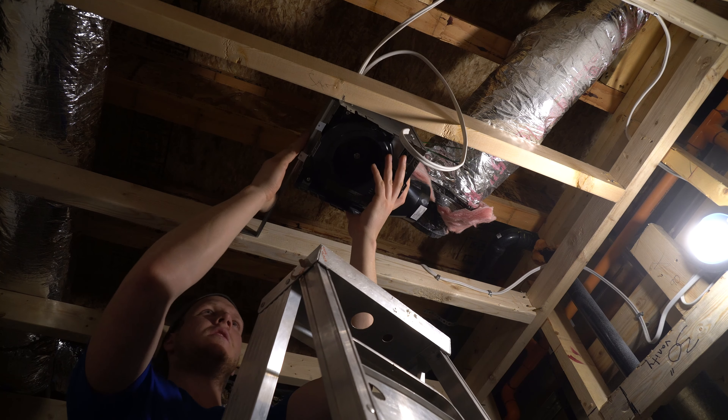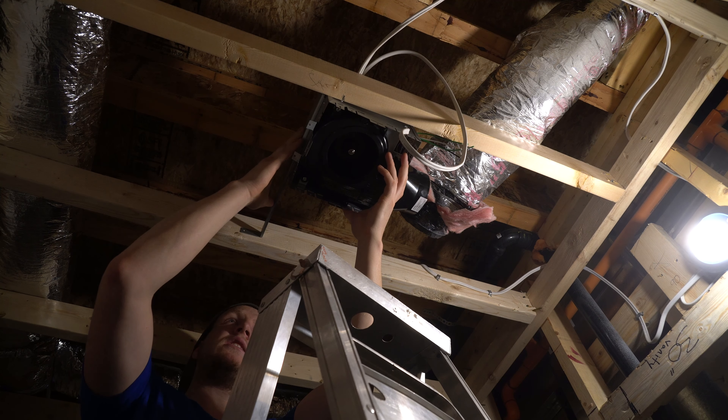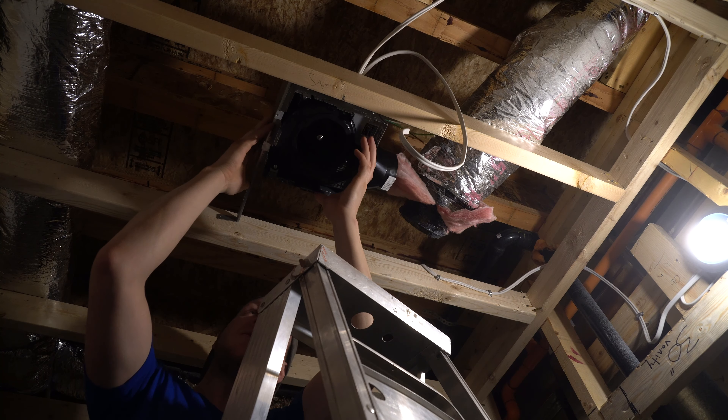This can come in here and will sit something like this. Now, if you have drywall, depending on what kind of drywall you have — if you're planning on installing 5/8ths drywall, you'll see that there is a 5/8ths tab on here and you would bend that out. If you're planning on doing half inch, you would bend out the half inch tab. My plan is to do 5/8ths.